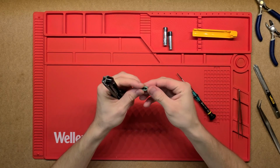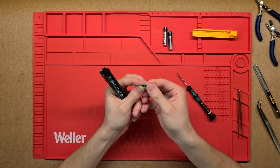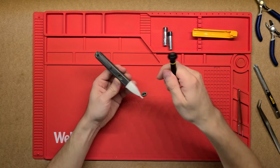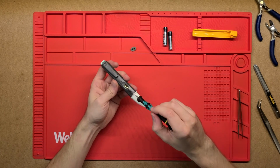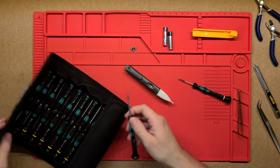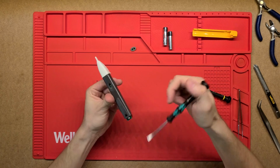I just pulled that button out. It's a little rubber button with two conductive pads on the inside, and as that gets pressed, it shorts these two exposed contacts on the PCB. I did that because I reckon there might be a little clip inside here that can loosen up and let that go. Just got this nice little pry tool. Try to do that, so it would have been slid this way. Yeah, so it's probably right there.